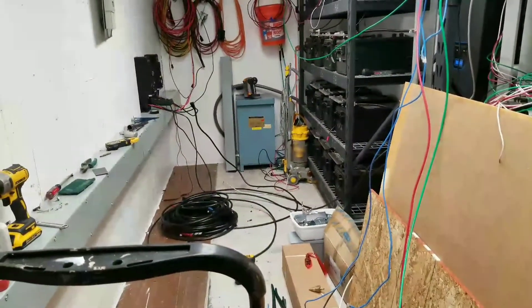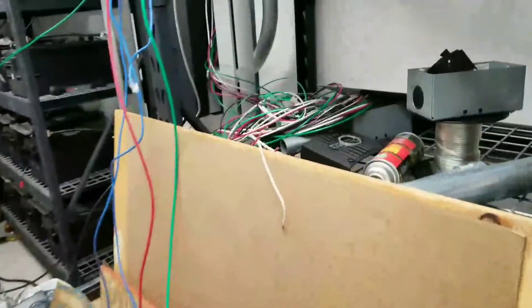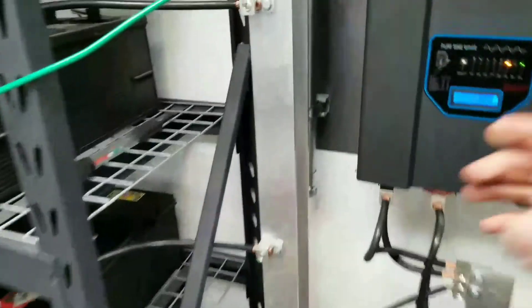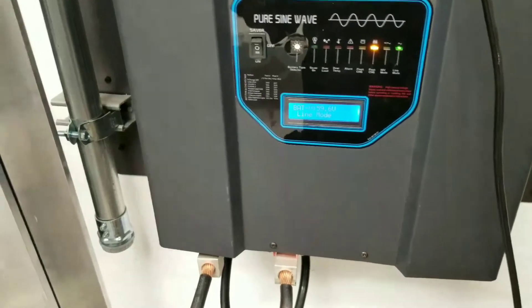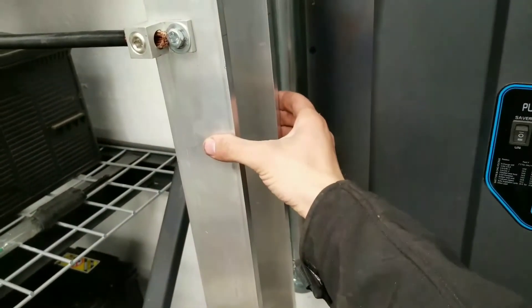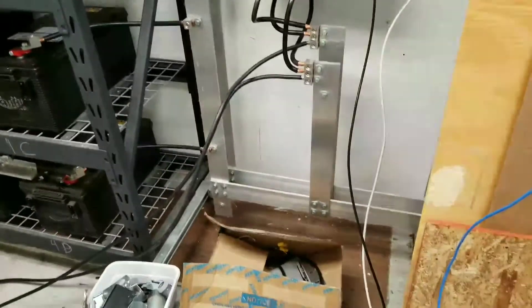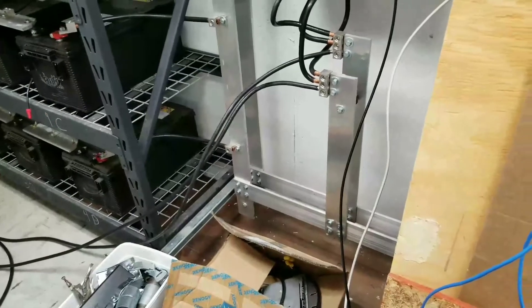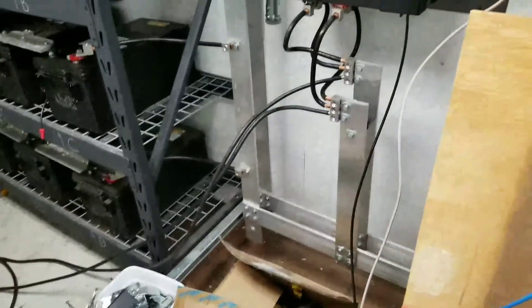This has been HitechLab — thanks for watching. Post any questions in the comments below. I've done all this work in here with this bus bar still exposed — I've disconnected and reconnected these aluminum cables over here, and this stuff is fine. Right now we're at 59.6 volts, basically 60 volts — I can grab it, absolutely no problem, no concerns whatsoever as far as touching it. There is the concern of dropping a tool on them, but I'm very careful with my tools and I have them typically wrapped in electrical tape — the ones I use on the bussing especially wrapped in electrical tape.